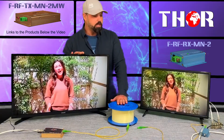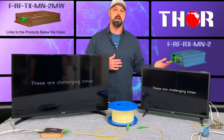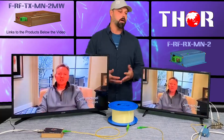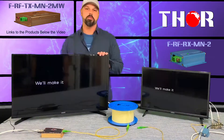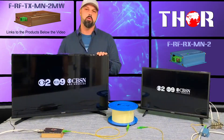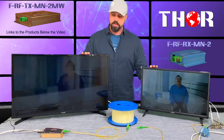So you can really put an antenna wherever you want and run single mode fiber back to wherever your home is — in case you have an additional house, or you want to go to a pool area, or whatever the case might be. If you just want to run antenna over fiber it's really simple. You go to your television menus and do a channel cable scan for air. The other option is QAM DVBC — we're not using QAM today, we're using ATSC off-air 8VSB.